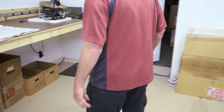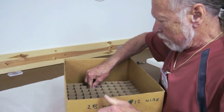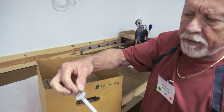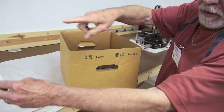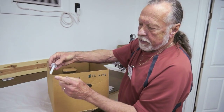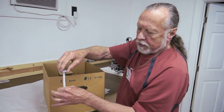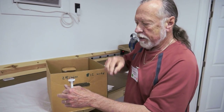Then over here are stems. The stem is the device that you attach the electron gun to, and then that goes on the lathe, and it's welded to the bottom of the tube. And then this is the stem that goes into the oven's pumps. This is where the vacuum pump hooks on and sucks the air out.